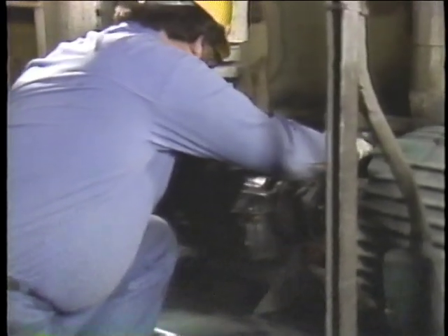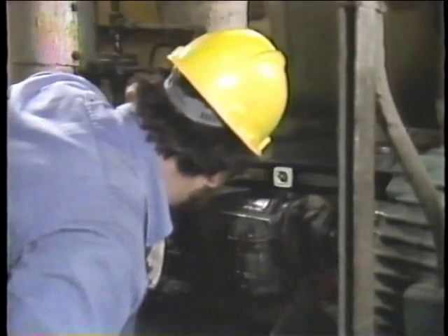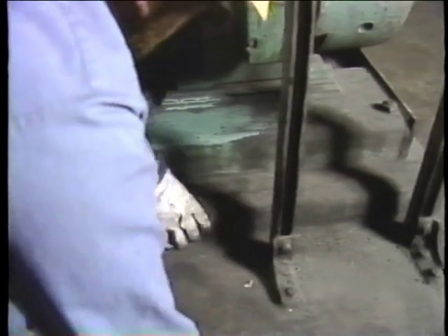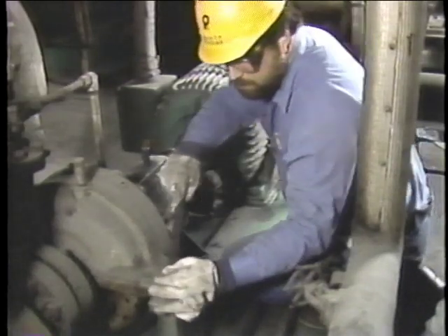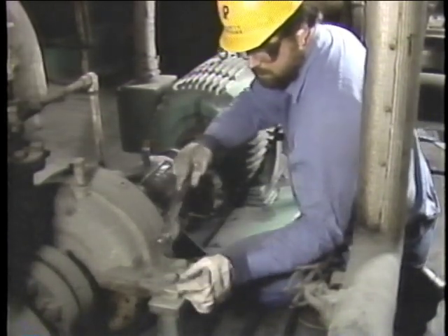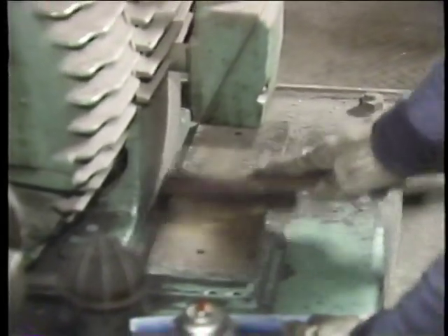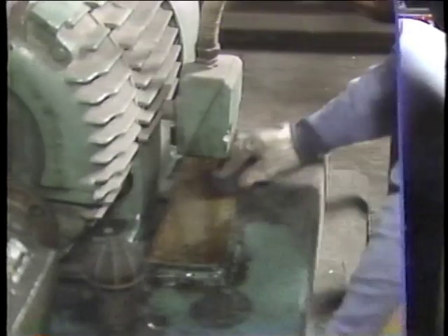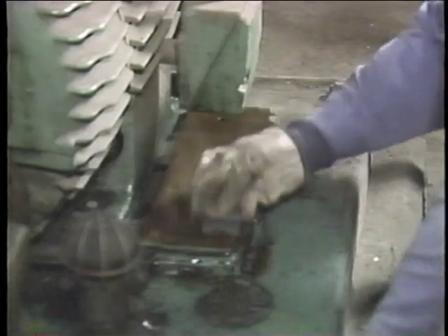The foundation should be checked with a bubble level to ensure that it's level. If it isn't, you'll have to verify that the fixed component has been shimmed to make it level. If the foundation is concrete, you'll need to make sure there are no cracks or loose material that will create an unstable platform for the equipment. It's also a good idea to check the mounting bolts — they should be tight and the bolt anchors should be securely set in the foundation. The surface of the foundation where the movable component sits should be clean — remove any corrosion, paint, or anything else that would interfere with the frame sitting solidly on the foundation. The seating surface should be stoned to remove any nicks, burrs, or other raised imperfections. Each foot of the motor should also be cleaned and stoned to make sure the motor sits solidly on the foundation.